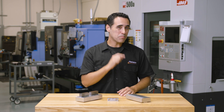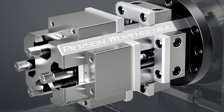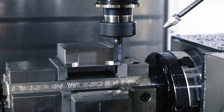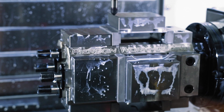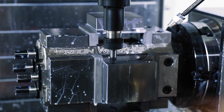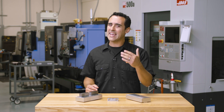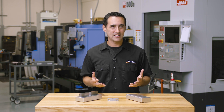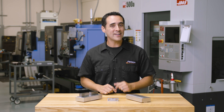Let me give you a quick overview of that. The Roto-Vice is a simple-to-use bolt-on workholding system that harnesses the typically unused extra Z volume of the machine to not only achieve high-density workholding, but also to access multiple faces of a part, which radically reduces setups. The Roto-Vice allows you to hold four parts per cycle and access at least three faces of the part — a 12-time production boost compared to a standard vice. Four parts times three faces equals 12 times more work in only one setup.